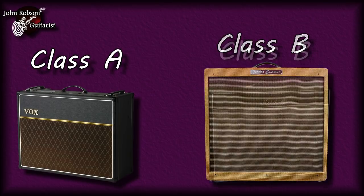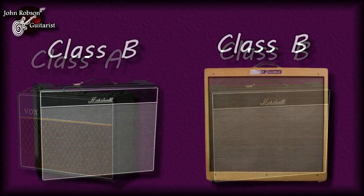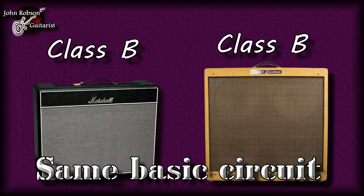All of this is why a Class A amplifier sounds markedly different from a Class B amplifier. It's well acknowledged that Jim Marshall, when he began making amplifiers, used the same basic circuit as Leo Fender - apparently a circuit taken from an electronics textbook in the public domain. The reason Marshall amplifiers sound different from Fender amplifiers is because the components available in the USA that Leo Fender was using - the types of valve and so on - weren't available in the UK, so Jim Marshall had to source the nearest equivalent components and tweak the circuit accordingly, resulting in a different sound.